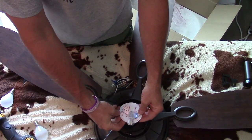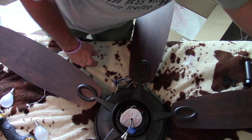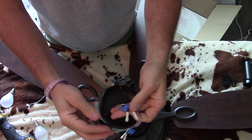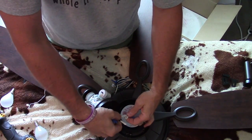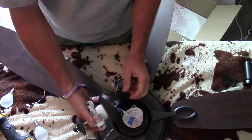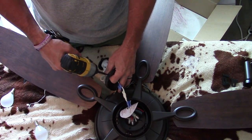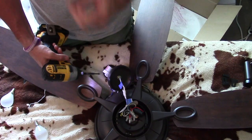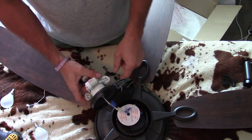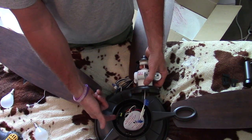This right here is for your light kit. The two different connectors here can only fit a certain way — you just match the white wire up with the white wire and then the black wire up to the blue wire. The screws for this are actually in this part. When you put this together, there's a little notch missing out of here — that's to fit over where your selector switch is for your forward or reverse on your ceiling fan.